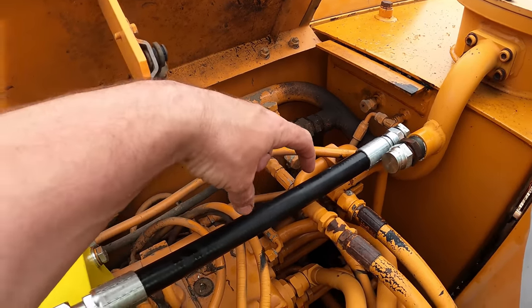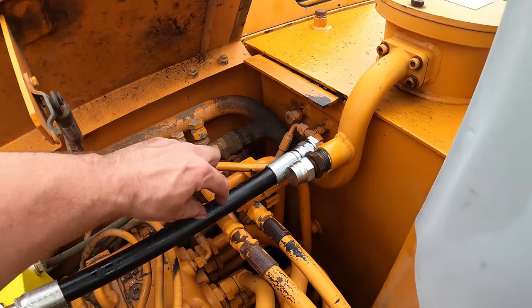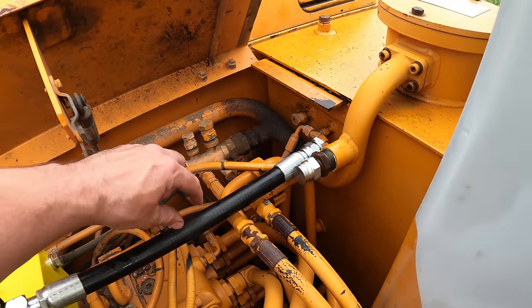And by the time they were done, there was only like this much hose left on each side with all the fittings in there and stuff. So once they showed me that, I figured that this hose would pretty much become a solid hose that would not even be movable at all. And I do need it to move slightly because this whole assembly moves around from vibrations and stuff. Plus this is not exactly perfectly in line with this, so it needs to flex a little bit.